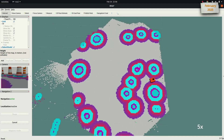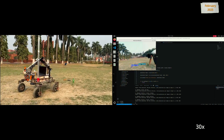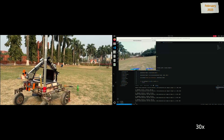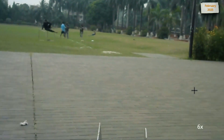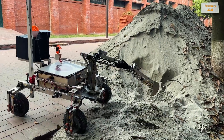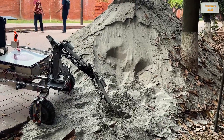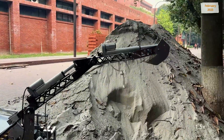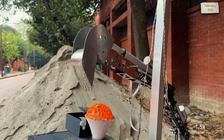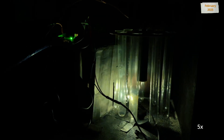The RealSense depth imaging along with localization is used to generate a dynamic cost map of the rover's environment. Our rover detects and localizes bottles and mallets using a custom-trained single-shot neural network. The rover uses high-resolution cameras for panoramic images and geological analysis, and stores GNSS data for accurate site documentation. For the subsurface sample, the rover's scoop first clears the top centimeter of soil, then collects the sample from below that depth and stores it in a 3D-printed sample cache with a servo-controlled lid. The sample is dropped through a sieve to filter out larger particles before passing through a funnel into test tubes inside the science box. The science box features rotating test tubes, built-in cameras, and spectrophotometry.